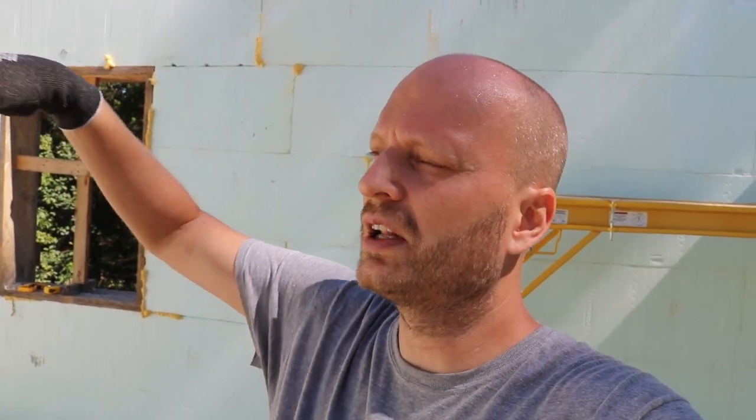That being said, let me go ahead and end it here. I'll show you the trusses, because we did get the trusses in. They're sitting down there ready to go. And I already pre-cut the siding, the OSB, for the end caps of the house. Once we get the heavier trusses up, we're gonna glue and nail those in place up here and then set it in place. But to alleviate the weight, we decided to not do it down there. We're gonna do it up here. But that being said, let me show you the trusses and we can go from there.